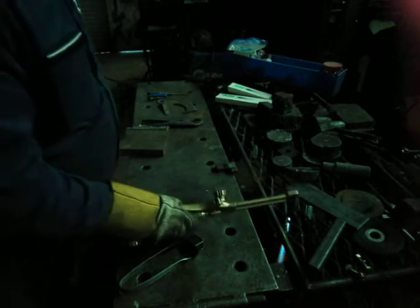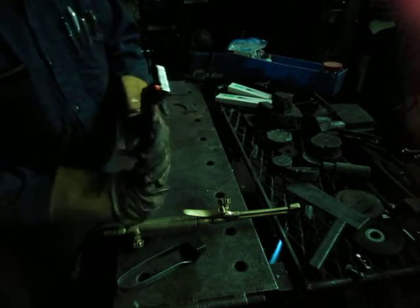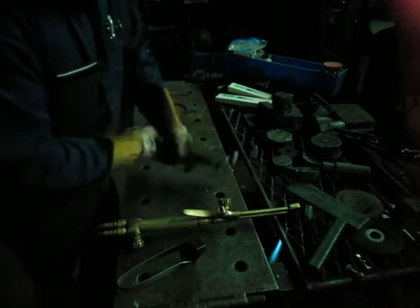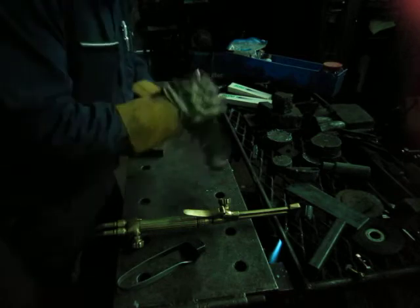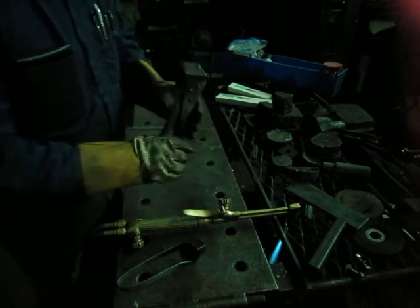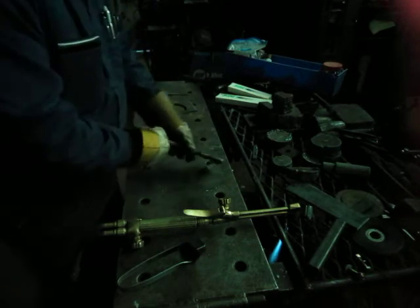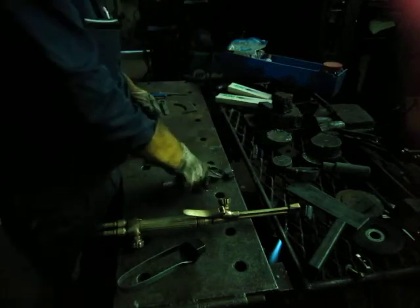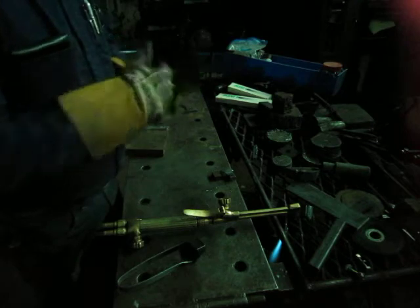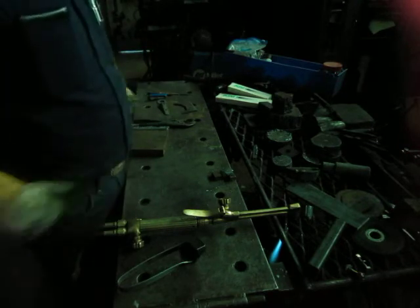Now that was fast. Notice the heavier slag — a little harder to get off, but it will come off. Still a decent cut. That travel was a little bit fast to get good slag removed. Part of the only reason I got away with doing it that fast with this small a tip is because the piece already had a lot of heat in it.